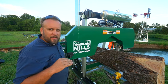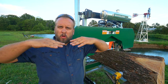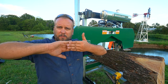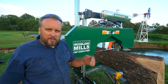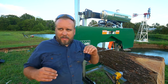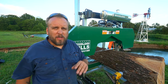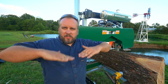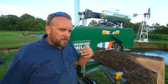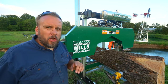The biggest problem I think is this frame — I would call it semi-rigid. So it can tweak just a little bit. It's bolted together in sections that overlap the trailer frame and the sawmill frame, and it's got a little bit of flexibility in it, which I think is required. It's also got six leveling jacks around the mill so I can level it out. Whenever I leveled it, the middle seemed like it needed to come down just a tiny bit. We lifted the jacks off the ground and that middle still didn't go down, but it was really close. Then we set the log on and it kind of sunk in. My interpretation is that when you set your mill up in a new location, you should set a log on before leveling the mill.